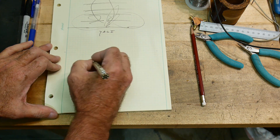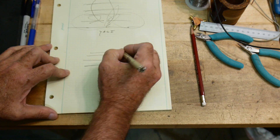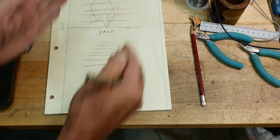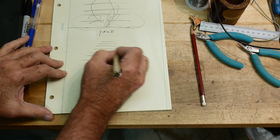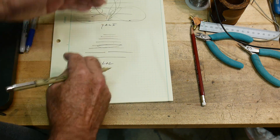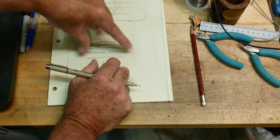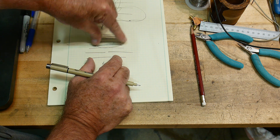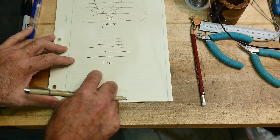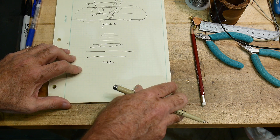You can take this further: have your dipole and reflector, and then a whole bunch of different-size reflectors. Remember how the discone antenna worked — the E&M wave finds one it's happy with? Well, it'll find one of these that it's happy with. These are called log periodic antennas, and log periodic antennas are very, very broadband because there is always some place for that E&M wave to be happy — it finds its spot with its wavelength. You can also see wild spiral log periodics that NASA uses.